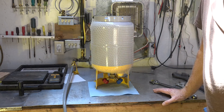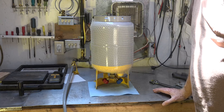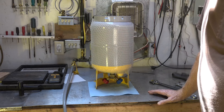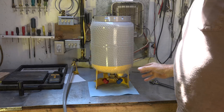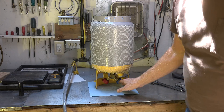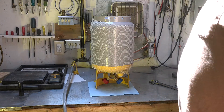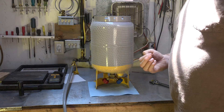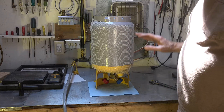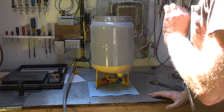I had a comment on a video I did about oil coming out in liquid form when it's recovered from a refrigeration system going into the recovery cylinder. What I demonstrated was: I took a cylinder that I had been using for a number of recovery operations, turned it upside down, and opened the valve to dump any oil that could be in it. Then I recovered a system — three-quarters by liquid and one-quarter by gas — then put all the gas back into it, which should have left the oil recovered with the liquid in the cylinder.